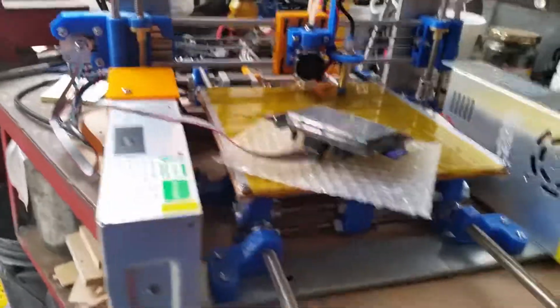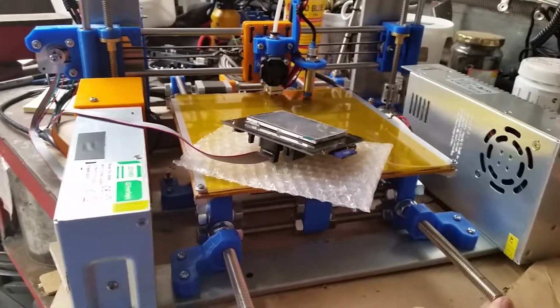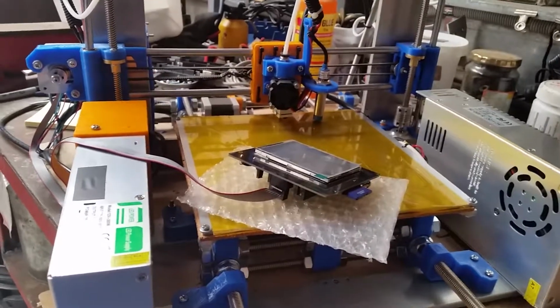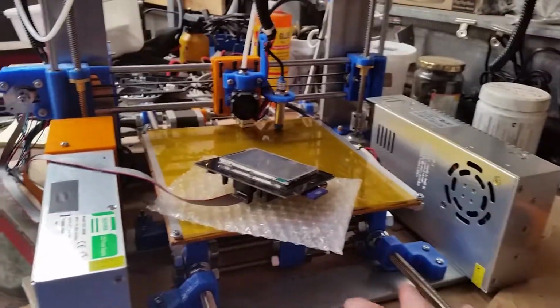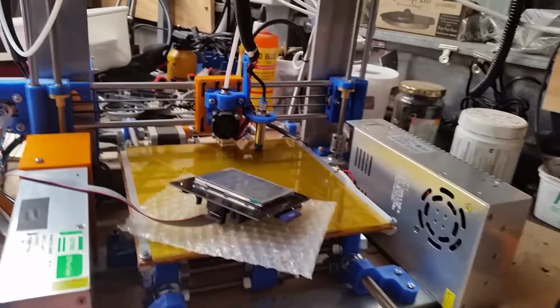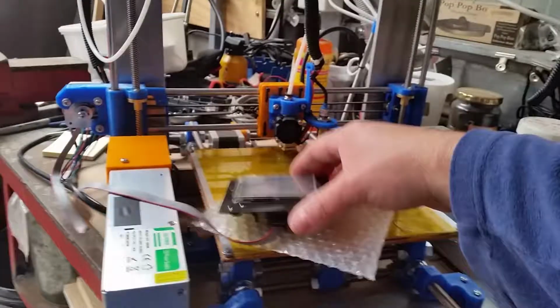So the power supplies are bound together. I used the extended rods which I had to extend for the reinforcing of the Z-axis, to prevent it from wobbling. So I kept the length of the rods. I'll end up showing these a little bit, but I'll end up mounting an aluminium angle that'll come across here, and I'll probably have some form of LCD mount that'll sit on the front, because where the printer sits, that'll be about eye level. It's actually fairly high off the ground.